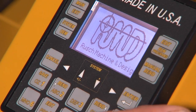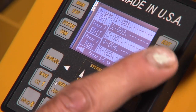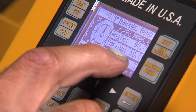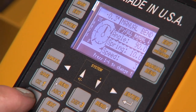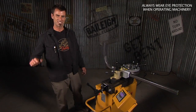Now in your control panel, you can do up to 175 different jobs. If you come out of this, we'll go into manual bend, and you can set your angle, set your spring back — which we've got at 10 — and then this is your speed, which we're going to set at six speed, full blast. We're not starting at one or two — six speed, shift it in.